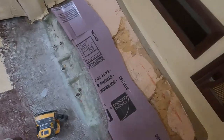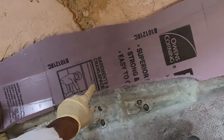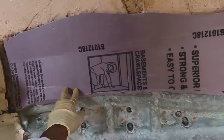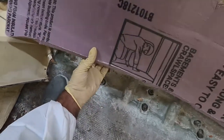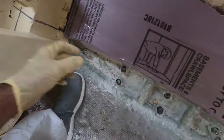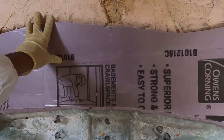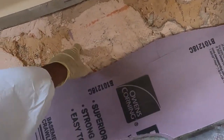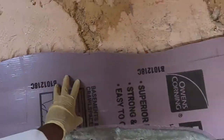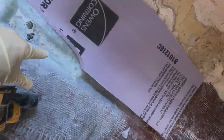So what I'm going to do — this is Owens Corning foam that you can buy at Home Depot and it's closed cell, so it's not going to absorb water. It has a plastic coating on each side of it and I've already peeled the plastic coating off the back of it. I'm going to put this in here and fill up these areas with thickened epoxy. I don't want to pull this out because I want to leave as much of that as possible. There'll be a small piece here and then a little strip right through here.